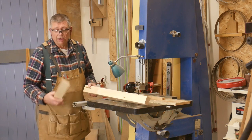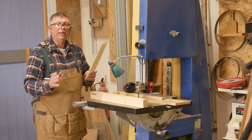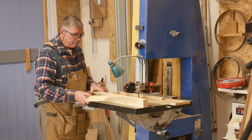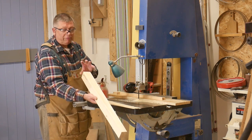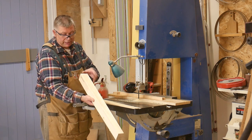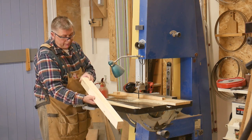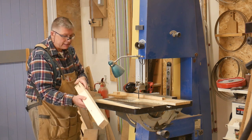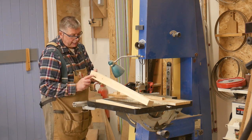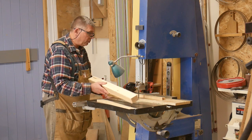And that's a nice clean cut. Save the offcut — you never know when it's going to be useful when you want to clamp things up. So the next thing to do is the second cut and we turn the workpiece anti-clockwise so that we've still got a flat outside face against the jig and the other mortise is facing outwards.